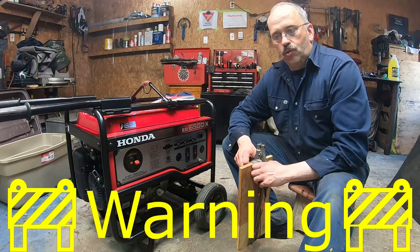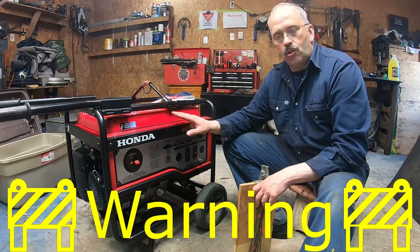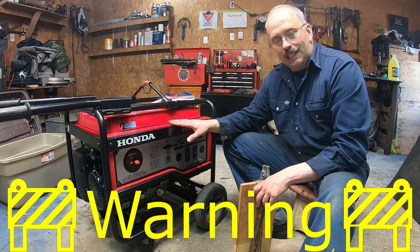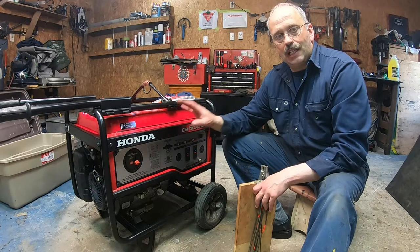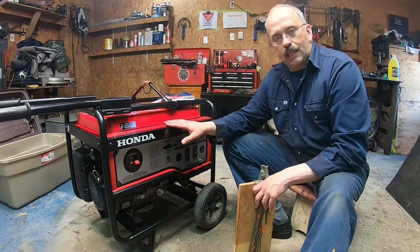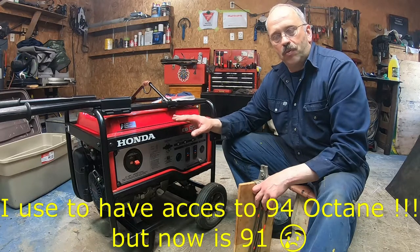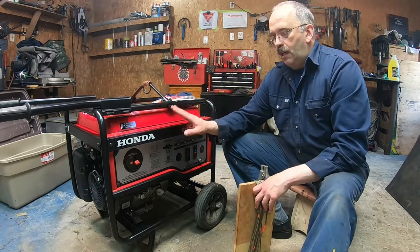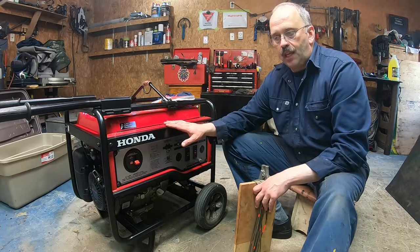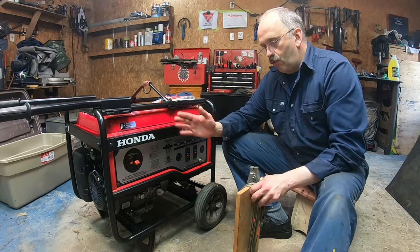Now, the second thing I would like you to remember is, if your generator runs on gas, always use non-alcohol, non-ethanol gas. Always use super high octane gas, whatever I can get. Here it's at Petro-Canada. I'm very bad with numbers, but I think it's 92 or 93 octane. And I put an additive also to protect the fuel. Usually I run it every 6 months and I put a good load on it for at least an hour. That way it's good for the generator and also for the whole system.